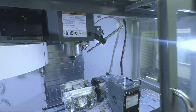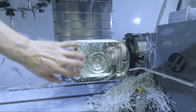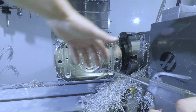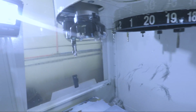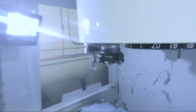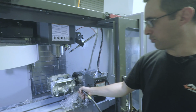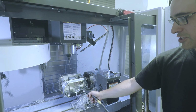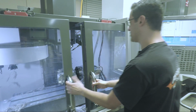Tool looks clear. Yeah, I just got to point out, awesome surface finish. Really, holy cow, really good. Feels great, and look at the mirror on that. That's a Kennametal tool? Yeah. Wow. It doesn't even look like a positive rake. It's actually a negative rake tool. That's interesting. It does a great job. I'm impressed. So one trick that we do, that hole that we bored through, now we can just blow in there, and any chips that are accumulated just come right out. We don't get that luxury on that side, but it's one little trick of running these parts.